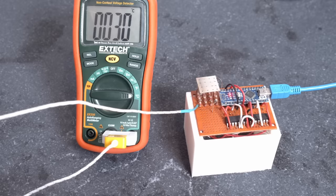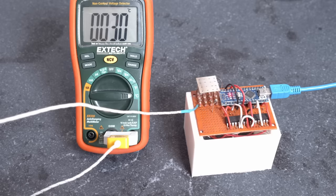As you address each resistor and pass current through it, that section of the mirror will shift upwards and you'll gain some deformation of the mirror at the top. The program currently running will heat up the left side of the mirror but not the right side. I've got the temperature probe stuck onto one of the resistors — right now it's around 30 degrees Celsius. When this LED kicks on, it'll start heating this side by passing current through it and we should see the temperature rise. It cycles every two minutes.